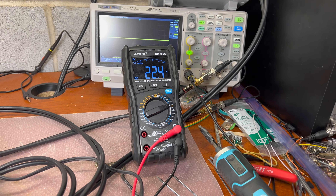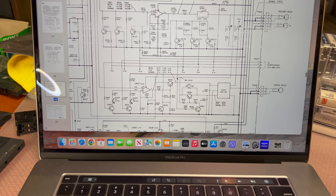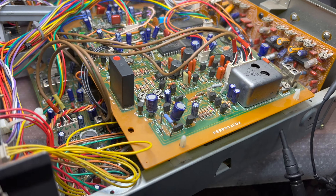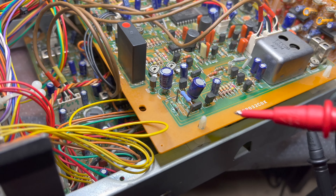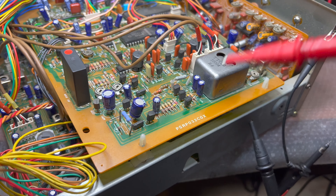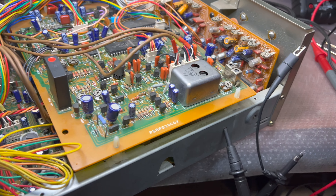This means the line between the collector of this transistor — where we have about 23 volts — and these downstream transistors and this amplifier is broken. That's where I'll open the board and check this trace. I started measuring from this resistor: it has 23 volts on one side and 8 volts on another side — that's fine. But after this transistor it just doesn't work.